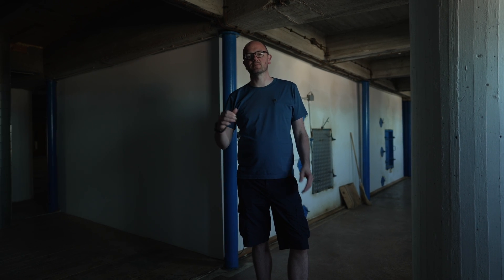Another layer down in the processing plant, you can see behind me this is where the moisture is adjusted — give or take three percent usually. They heat it up to bring the moisture content down by around three percent to reach the correct moisture content before it enters pelletization.